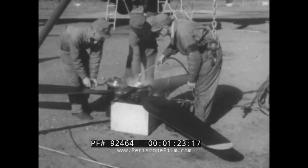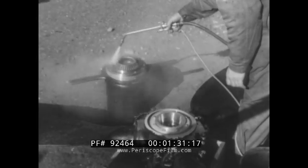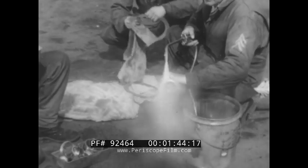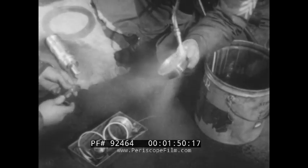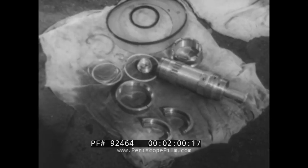Herb and Chuck carry in the prop dome and the boys go to work. Not only the hub but the prop dome gets a spray bath. Cover up that open end of the dome. Give these smaller parts — the innards — a cleaning too. Give me the bronze cone, Herb. I'll give it a bath while I'm at it, and also these two half rings that make up the front cone. Such cleaning brings these parts out into the open where they can be inspected for any signs of damage or wear.